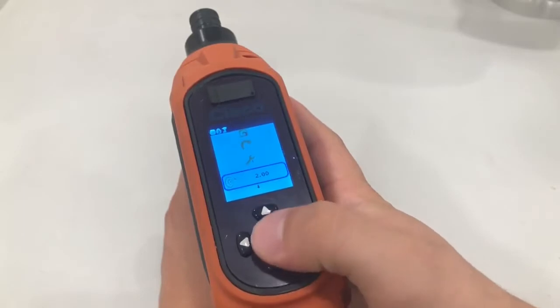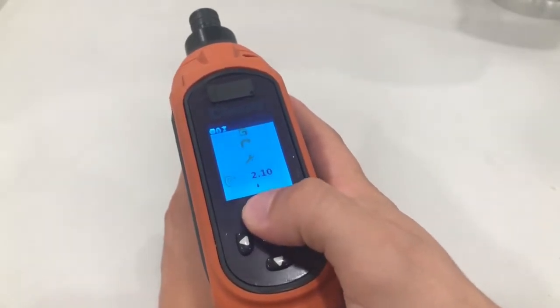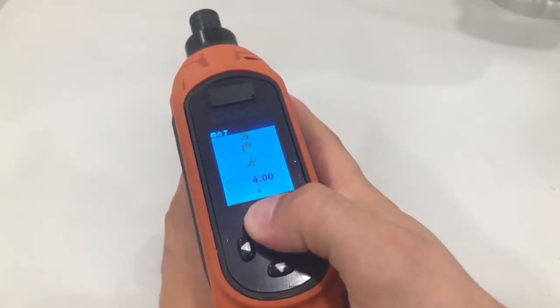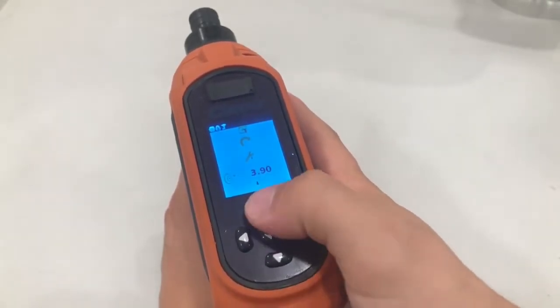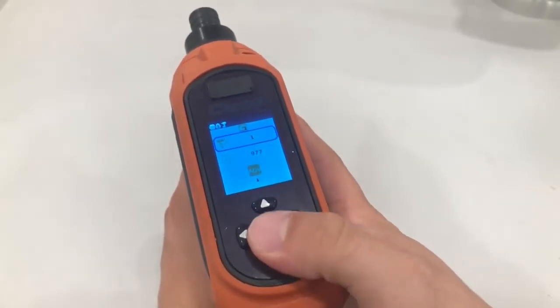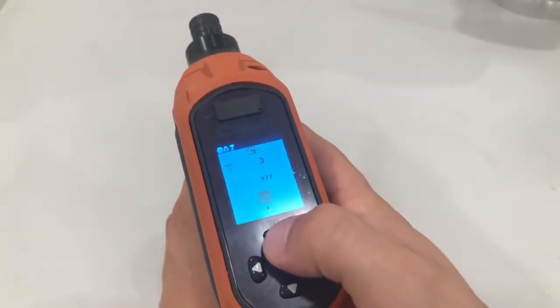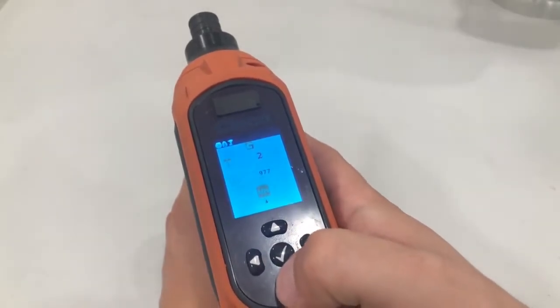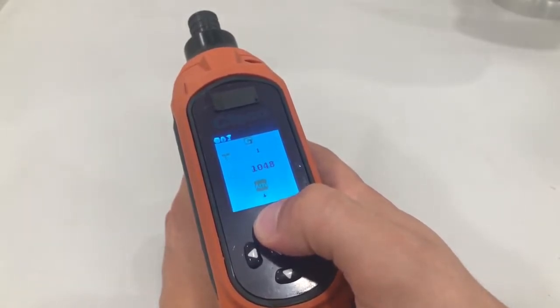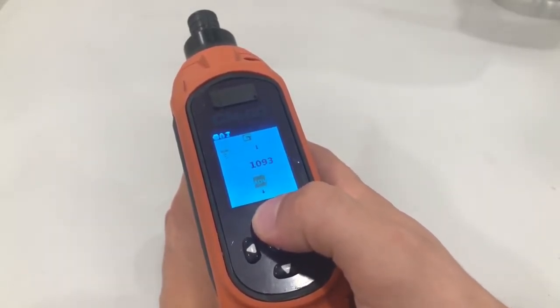Press and hold the left arrow button to go back. The bold side with the arrow is the torque target. Here we can change the value to any torque target that we need. Different CellCore models have different min and max torque targets. I will use the max target on this pistol which is 4 Nm. The batch display allows you to change the number of tightening positions or screws tightened in the program. You can also edit the tool's speed by selecting the RPM icon. I am going to use 1100 RPM for this rundown program.